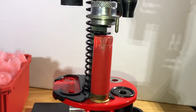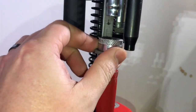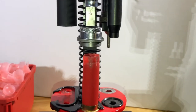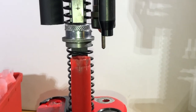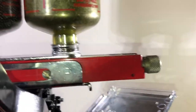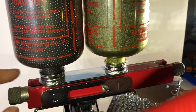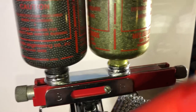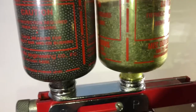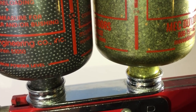With the pre-1982 models such as this one, the guide assembly for the wad is not spring-loaded — it's just retained in place, so you have to manually pull it down. Powder is the easy section. In the case of this adjustable charge bar, I can adjust it with the little knurled knob on the right. With standard charge bars, you'll have a bar set for a certain amount of shot — like a one-ounce, seven-eighths, ounce-and-an-eighth, ounce-and-a-quarter, and so on — and then bushings for your powder measurement. Just match your bushing number to a bushing table, verify your powder charge, and you're good to go.